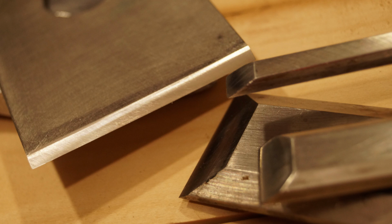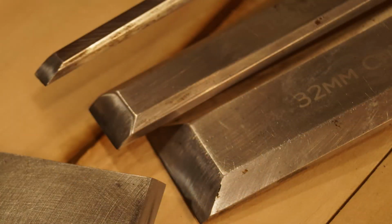Next type is semicircular chisels. There are some kinds of these tools: slightly rounded, medium, and strongly rounded. Semicircular chisels with a bevel on the convex side of the blade are used for wood carving and making recesses in parts. Tools with a bevel on the concave side of the blade are used for carving, cutting, planing, and cleaning profile parts, such as shaped trims.